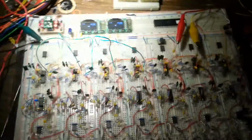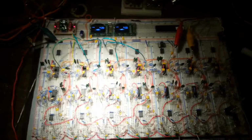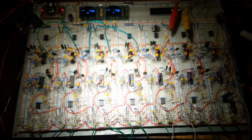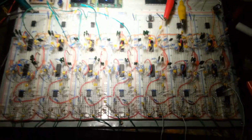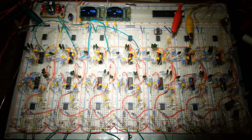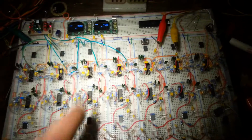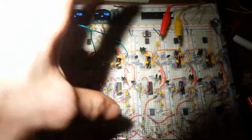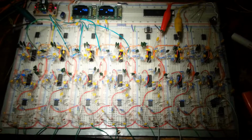So I finally got some nice multi-channel EMG going. It's repeatable, with nice clean signals, and it's taken a while. Now I'm going to compact all of this down to surface mount circuitry, and each one of these boards will basically be a little sub-module. I'm thinking of making little strip-like boards that all plug into a small backplane.